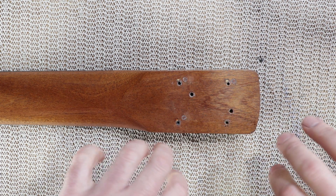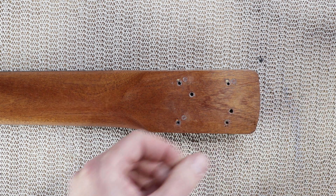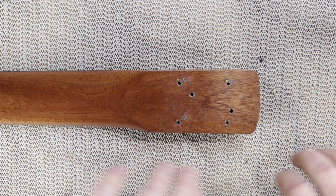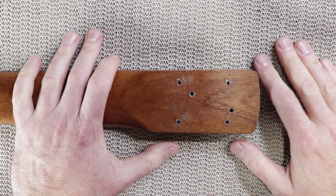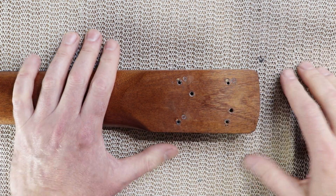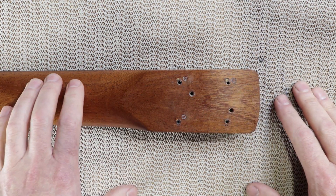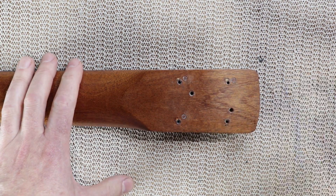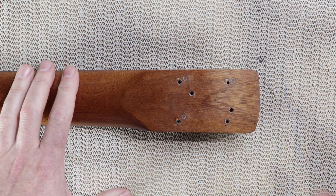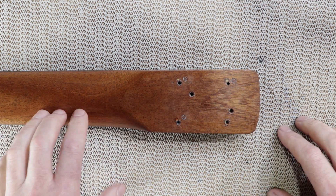I also like to think it spreads the load of the screw when it's tugging on those threads - when the neck is in place and the screws are torqued up, it spreads that load a little bit further into the wood fibers surrounding the holes. You might not think that's really necessary, because there are thousands and thousands of Fender guitars that just have wood screws straight into maple necks, and you'd be kind of right. But in this situation I think it's really important.